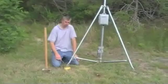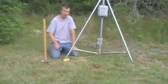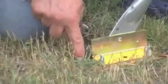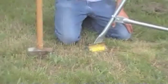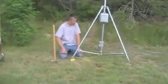We've driven the stakes that secure the tripod into the ground almost all the way in. I've left them up just a little bit so that if I want to utilize the hole on the washer that's welded onto the stake to hold the S-hook for my guy wires, I can. If I'm not going to attach the guy wires to these stakes and I'm going to run stakes further out, I don't need to do that — I can drive these right home solid.